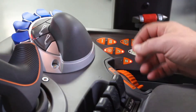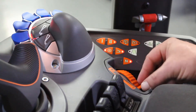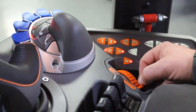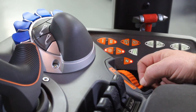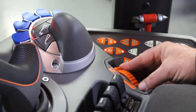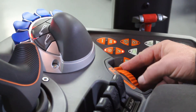The dial on the right-hand side of the armrest goes from min to max, and what this does is control what the max speed is with the pedal pushed all the way to the floor. So if it's rolled back to the minimum position, it's about three to three and a half miles an hour. If you put it to the max position, it'll be the max speed achievable in either low or high range, depending on what you're in.